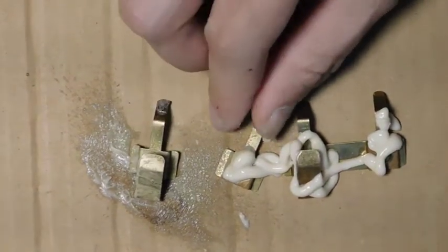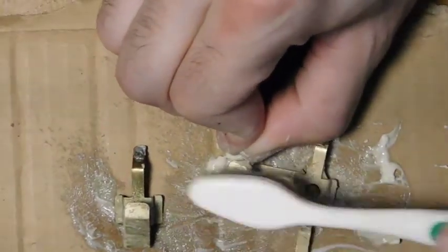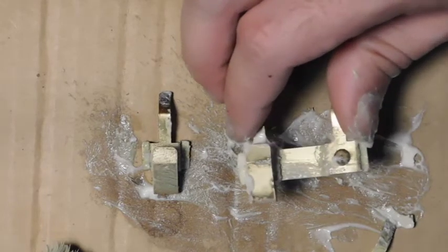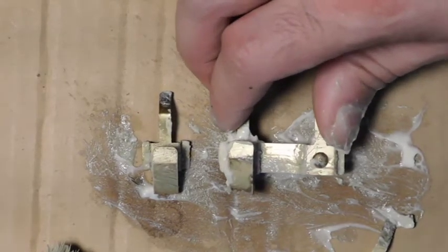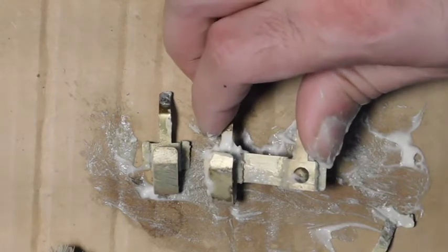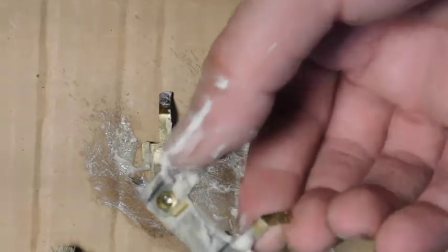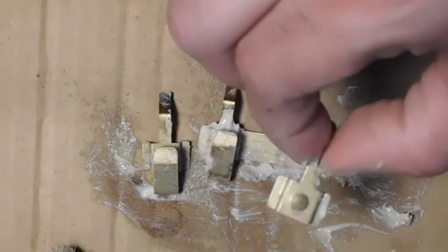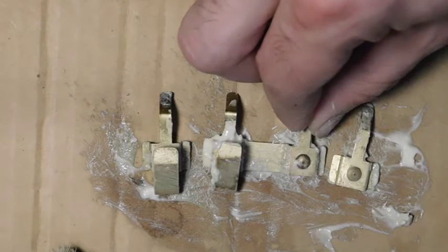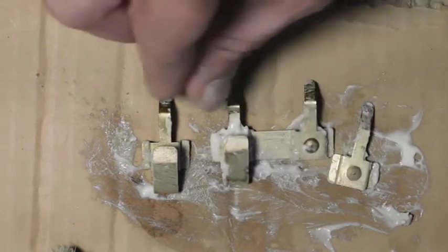You can already see it's made quite a nice difference. I think that's looking a lot better. What I'm going to do is rinse this in some acetone — nail polish remover. That should get rid of the Brasso and any residual grease. Acetone, some alcohol — all of that is good for cleaning this off, because I don't want to leave it behind either. It does seem to have made an improvement; they're definitely looking better, but I still don't think these are going to be conductive in their current state. In our next step we're going to make our electroplating solution, and I'll show you guys how to do that, then we'll electroplate these guys and make them work again.